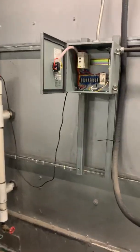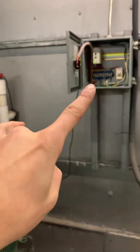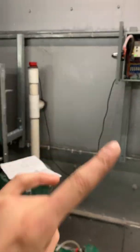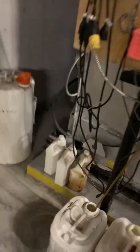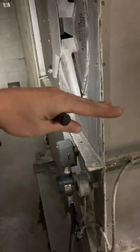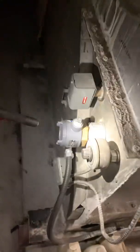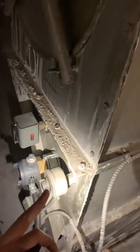Next I came over to the new low water level and max water level sensor for the fill valve. There used to be an old one on the system over here that was disconnected — it's just a little paddle sensor with a float. When the float goes up, water turns off; when it floats down, water turns on. You can see it's disconnected. Right there is the heater for the cooling tower, which used to run off that thermostat — also disconnected now — and now it runs off automation.